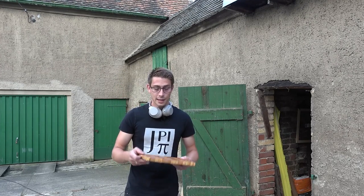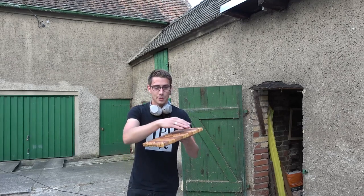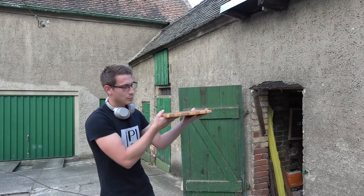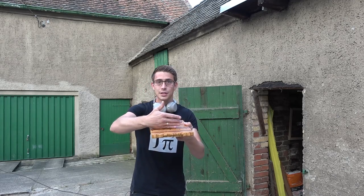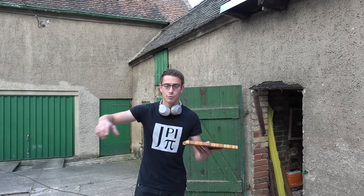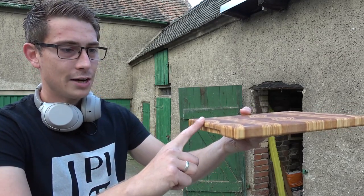So what's the problem with end grain exactly? On the one hand, end grain is magnificent to use for cutting boards because it can really dampen the pressure on your knife when you cut on it - it's way better than regular grain boards. But the terrible thing is, the reason why you can't let it run through a planer, is because all the wood fibers are basically pointing to the top. If you let a planer run over it, all the wood fibers get compressed in one direction and the blade hits against a thick wall. Also, if you try to use a block plane on an end grain board, you'll notice that on the corners and edges the fibers just split off and you get a very ugly edge.